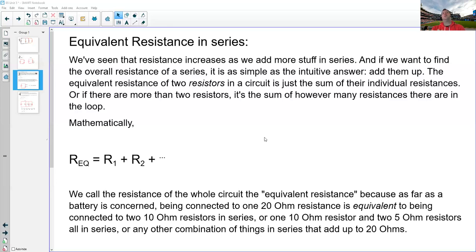To find the equivalent resistance of things in series, we know that more things in series makes more resistance — and this is something most students correctly predict. We just add them together. Now, we've been looking at bulbs because we can see something happen with them. The reason a bulb glows is that as charges move through the filament, it's a narrow space, so those charges rubbing makes it hot, and when things get hot enough, they glow. But not everything that gets hot glows — light bulbs are designed that way.